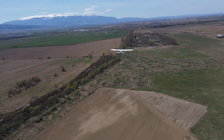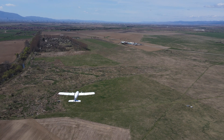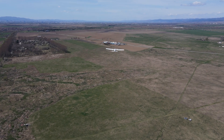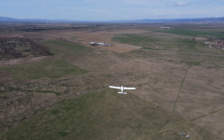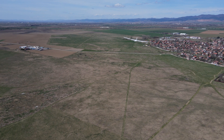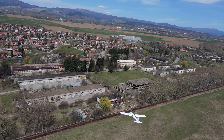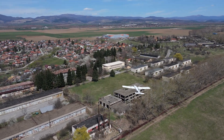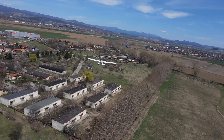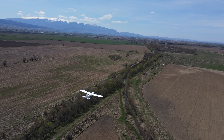The important thing is that the plane flies and it flies well — that X7 Plus flight controller is absolutely brilliant, at least it has been for me. The Neo3 GPS unit has also been performing exceptionally well and I've constantly been seeing 20 plus satellites throughout the whole flight. Keep in mind that a larger size brings with it higher drag, and I can definitely feel that here. The Flying Dragon flies at a higher cruise speed due to the smaller drag it experiences, but it will probably have a harder time than the Fighter getting off the ground with a 4kg battery, which currently constitutes more than half of the weight of the Fighter. There is more to come, especially since the plane is still in one piece following the initial flights and testing, so if you are curious to see where this goes, stick around.